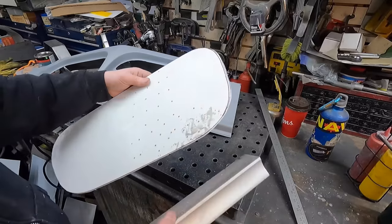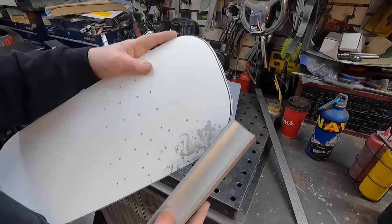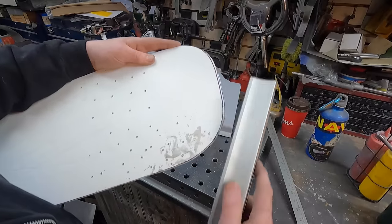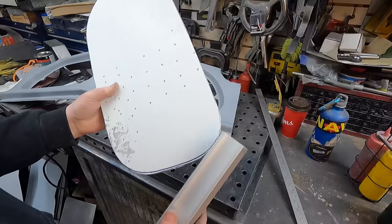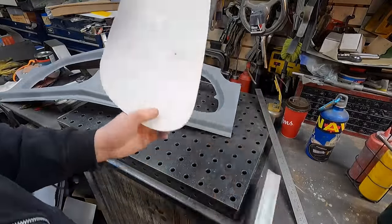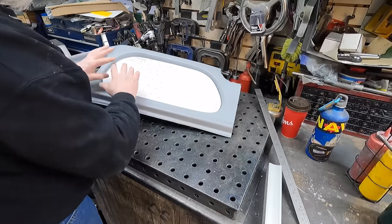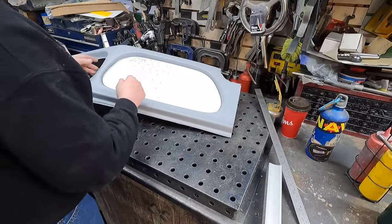So rather than show endless hours of me sanding this, I thought I would just give a quick demo of how easy it works. It's just standard foam board. I've obviously used it more than once. Keeping it around the garage is really handy. The 80 grit side of this block though, just forms it so nicely, so easy to do. This is the key to the whole project, is just keep moving it in, right? Keep checking it, and then little bits, just little bits. If I sand a ton off of it, then it doesn't fit anymore, and it ends up as a nightmare.